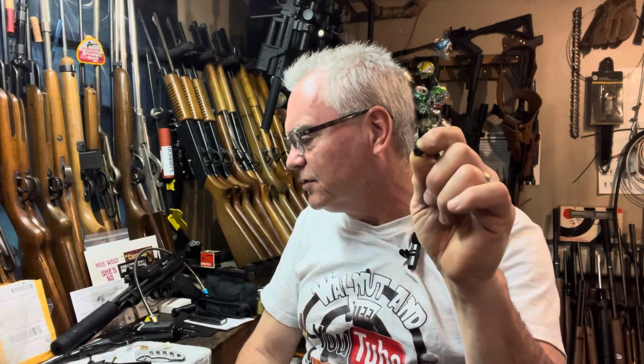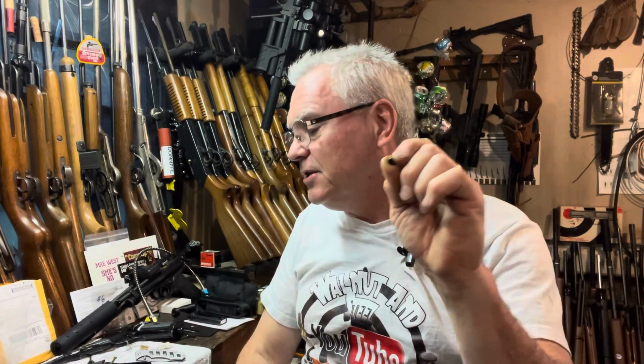that was in there. And most recently I wrote Henry and said, hey, I have these two guns, they have bad seals, and I found this, gave him actually the part number from the Crosman, and he said, well, this particular material is fine for a pneumatic gun, but CO2 reacts with this material and will cause it to get brittle and hard. And this one is hard as a rock and was leaking air when I took it out of my drawer to change it out.